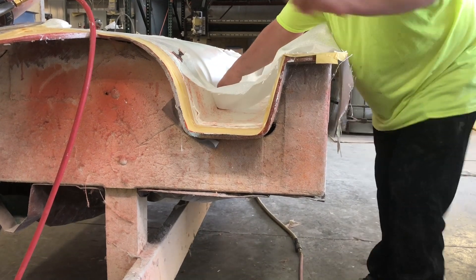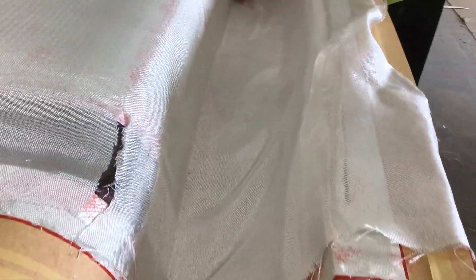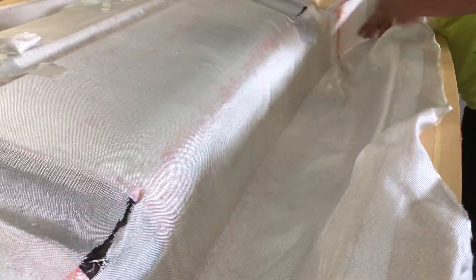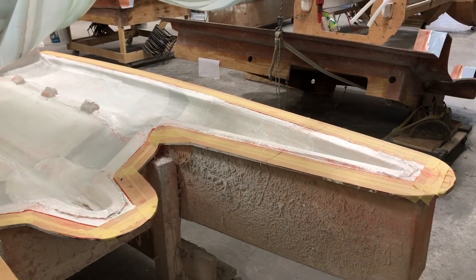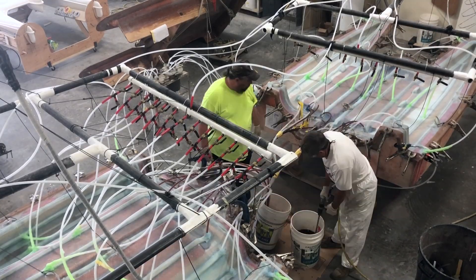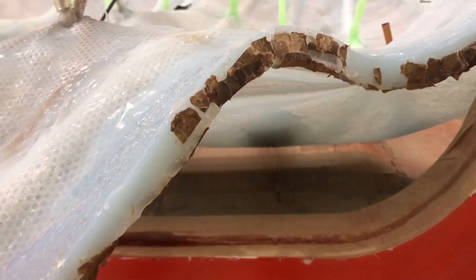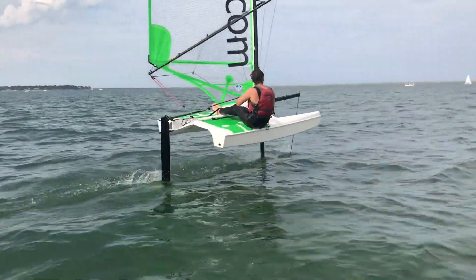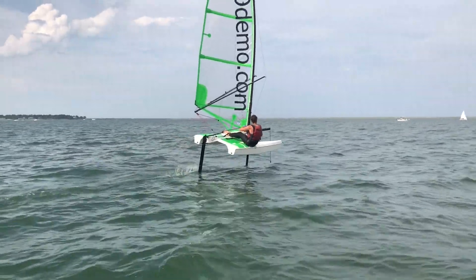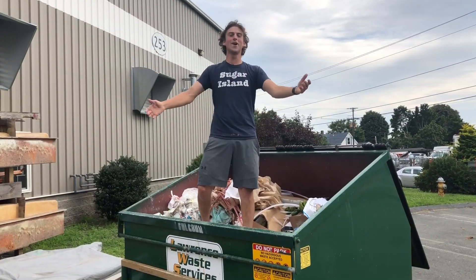So now, fabric is placed into the mold that will ultimately become the hull — this is the fiberglass laminate we will actually end up using, not a disposable piece of content. The reusable silicone vacuum bag descends from the sky on a hoist. The resin is sucked into the laminate under vacuum pressure, and the bag is once again hoisted up into the ceiling to wait to be used again. That effort, though it may seem mundane, enables us to do this without this — this with less of this.